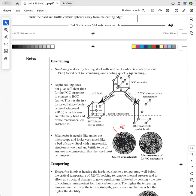And so when we have martensite forming, as I said, I used to actually get the kids standing on a bench, and I used to throw it on the ground, and they'd see how it would shatter. And once they've seen that, they realise how brittle it is. But I stopped doing that because one of the students hopped up on a desk and he didn't see the fan, and he got hit by the fan. So I had to stop doing that. But anyway, at least they remember the demonstration. So they saw the mold blade just fracture. I just had to tap it with a hammer and it would fracture.